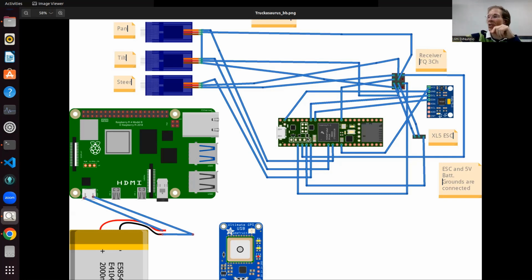And in addition, there's an emergency stop feature, where here's the remote control in my pictures and videos. The Robo-Magellan course and other contests require you to have an emergency stop switch. So in this case, when it's in automatic mode, I have to keep the full throttle on, and if you let go, the robot stops. That's why I wanted to use this as a multi-purpose thing. In manual mode, it controls the robot as a normal RC car. And in auto mode, you must hold the switch on for the automatic system to be able to move the car.